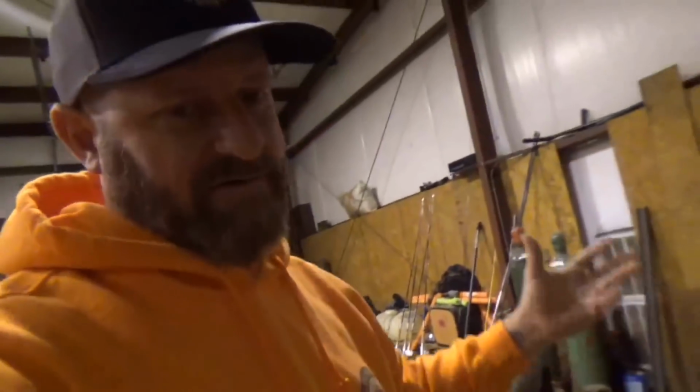It scared the crap out of me because it sounded like a shotgun went off in here when it blew off. But it didn't go across the shop because the hose hung it over there. Like I said, there's a lot of people who run air through PVC, and I just had that 90 split and crack up. I got a hairline crack, and that 90 over here actually exploded, and that was probably a couple years after I did that. So I'm gonna put y'all down for right now.